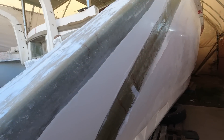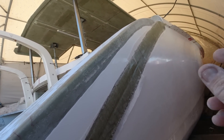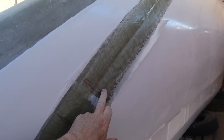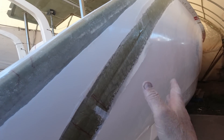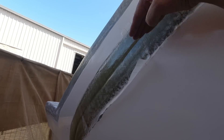Have a look here — basically four layers of 600 double bias. I put two thin layers in just to fill the gap there, so we shouldn't have too much of a gap once I remove this peel ply. They'll be able to sand this all fair, get some fairing compound on it, and then spray it all the way from here all the way up — that'll be one piece, easier to fair in rather than fairing gel coat then gel coat again. Fair that whole thing in one piece and integrate it all back into place.